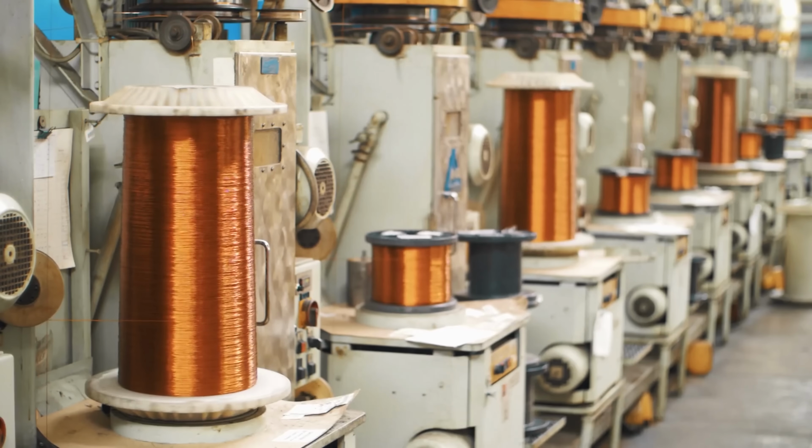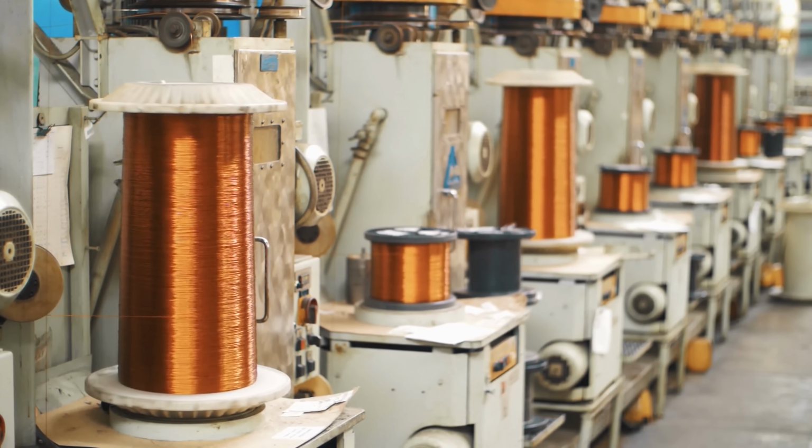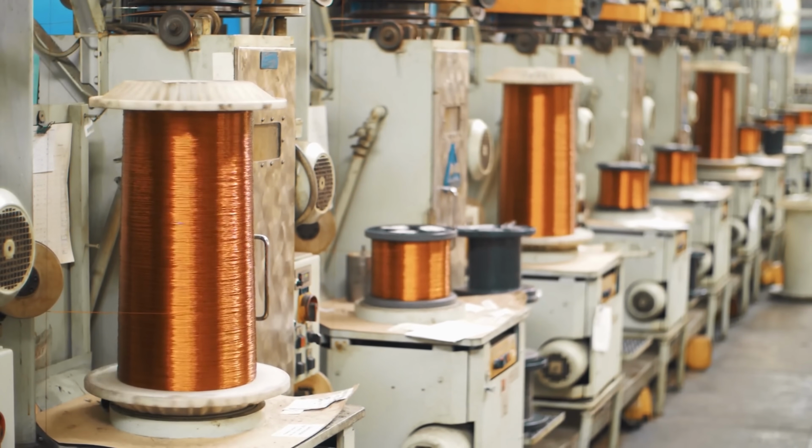Obviously, we can create a magnetic field that attracts something to it. Coils of wire make excellent electromagnets. But we can't simply create a magnetic field around a magnet and get useful motion. Sure, it will attract the magnet to itself, but once it's done that, well, then it won't spin, will it? It'll just sort of move a bit and then get locked in place. So we need the magnetic field itself to spin.